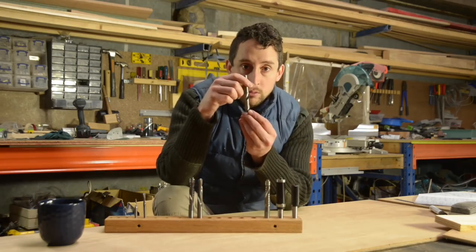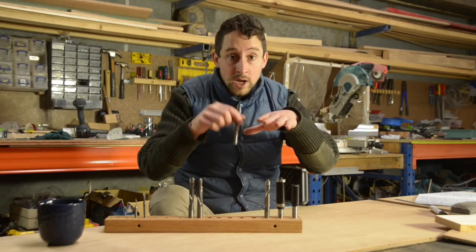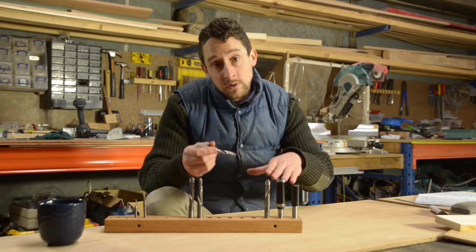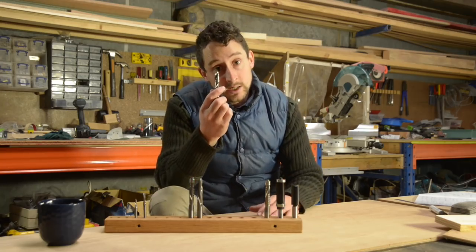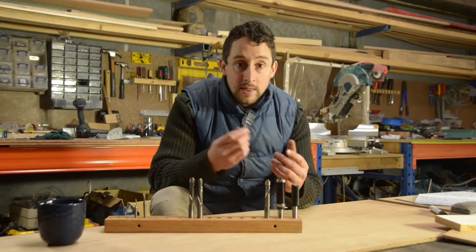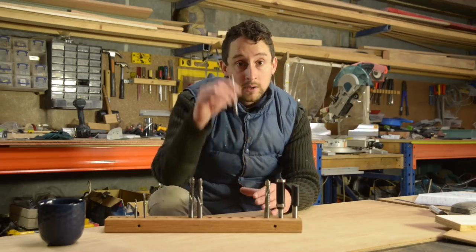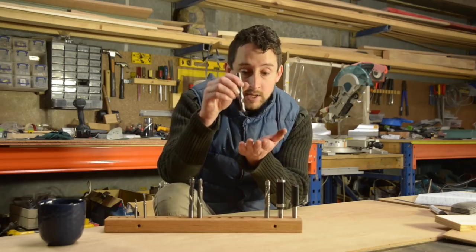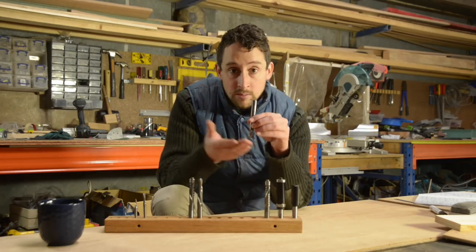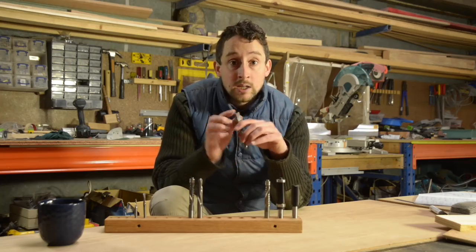Because this is acting kind of like a drill, it's actually going to hold your handheld router into the piece of wood. Conversely, if you're using this in a table router, it's going to hold the piece of wood down onto the table. That can help stabilize things in some ways — it's going to stop the router jumping around. One byproduct of that is if you're cutting a little trench, the bottom edge of the channel on a spiral up cut bit is going to be really nice and clean.